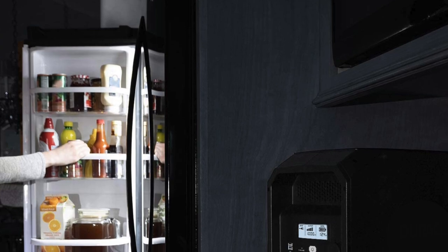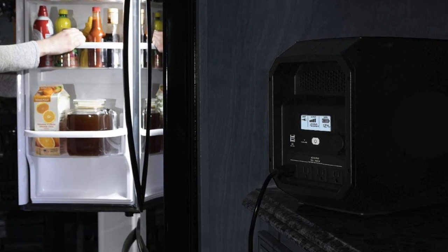And what I'm looking to do is just provide one that provides 600 watts continuous and 1500 watts peak. That's where if you turn on something, usually when you turn on something, there's a power draw in the beginning, then it goes down. So basically, for my parents when they were living down here, what I've been able to do is set up a system like that for them with one solar panel producing 100 watts. It's enough to charge up the system that I'm selling.